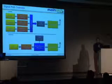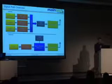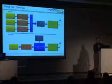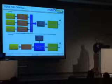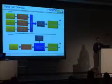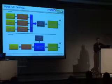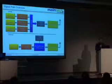And after that, several additional data streams are inserted. It's the program service information tables, which tell the receiver what programs are in that stream and what the names are and who is broadcasting them, and what needs to be done to receive them.